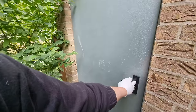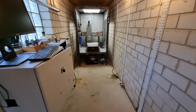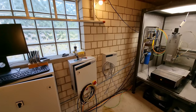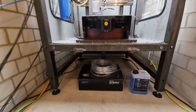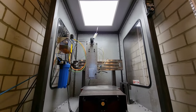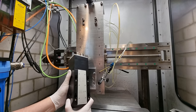Onwards to the forgotten overgrown ruin that was once the CNC shed. I've cleared out some of the horrors lurking in here, but there is still a ton of work to do. I'm dissatisfied with my CNC machine and I'd much rather start a new one than patch all the mistakes I made early on. I need flood cooling, better way covers, and better cable management. Everything and everyone to set foot in this room gets a nice coating in oil and sticky microscopic aluminum chips — I found them in my hair, in my bed, and in food. This has been the number one inconvenience, and I'm hoping to solve it with this upgrade to a spindle that delivers meaningful torque at lower RPMs.